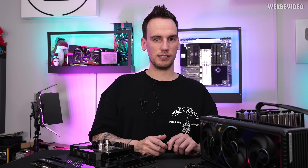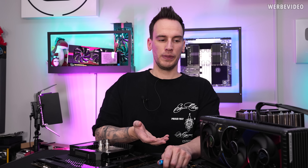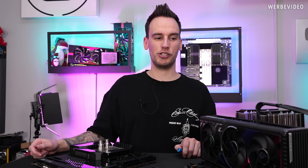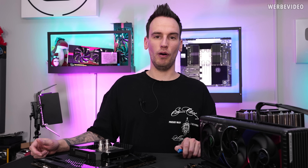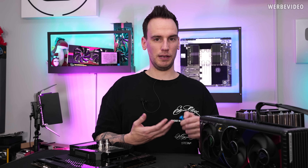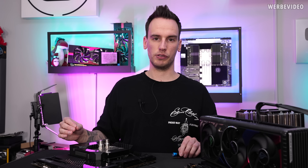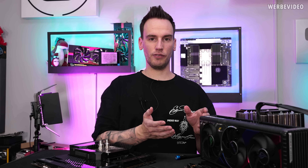I got in contact with Chris again and asked his opinion. He said that it might be that if one chip was damaged, then actually all of them could be damaged. But at the point when he was checking them, only one was faulty. And now maybe during transport - because it was shipped all the way through Germany - some vibrations may have caused a second chip to become damaged. He said the best option is probably to reball all of the memory chips and check if this helps. So I will just send it back to him. Also, if you would have the same situation and receive a repair back that doesn't work, there is a warranty on his repair, so you can return it and he will fix it again. From what I can see, this is not his fault - you could see everything was working and now it's damaged again.